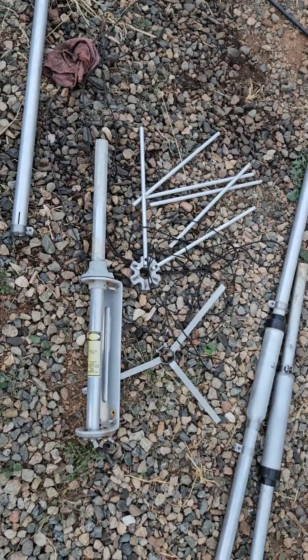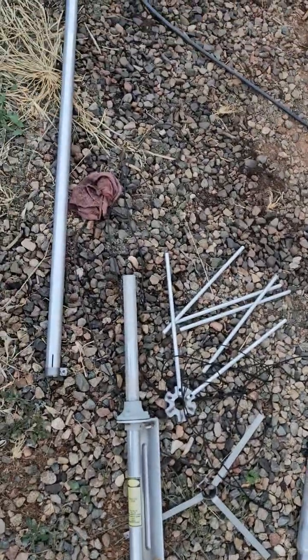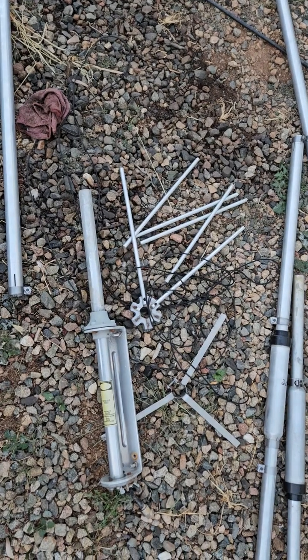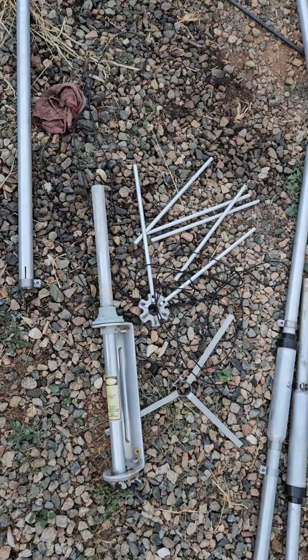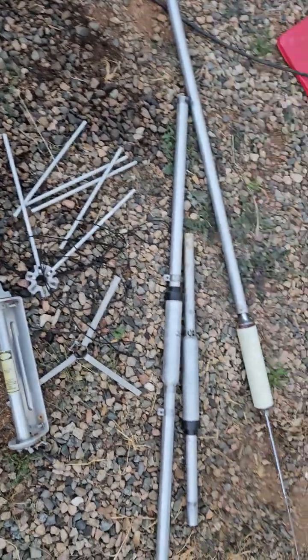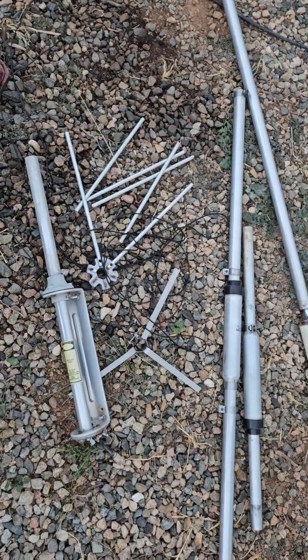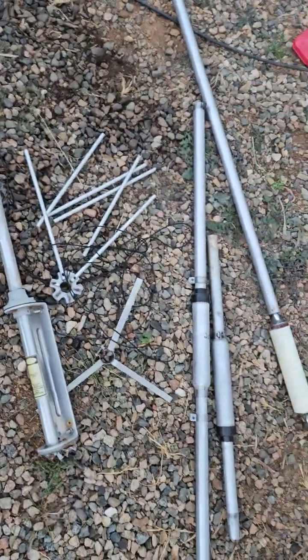There's not a lot to these. I had opened up the trap on one of them earlier and showed you guys what it looked like — there's just a coil in there. I don't even think there's anything else; maybe there's a capacitor across it, but I doubt it. I think it's just a coil, and then the coil acts like a separation in between each band.